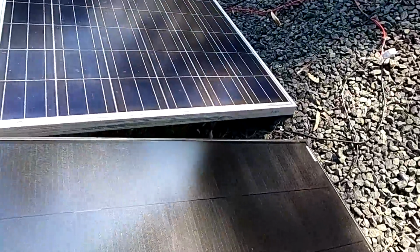And you can also potentially see here these little bridges. I think they have split them up again, and this is where the bypass diodes are sitting. So 1/3 of this lane can be shaded and can be bypassed, while the other 2 are still producing. And this makes it far more efficient because we've got a combination of series and parallel connections here.